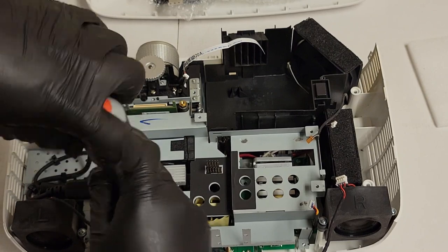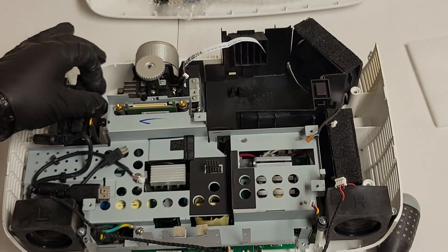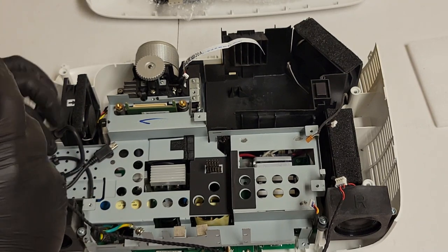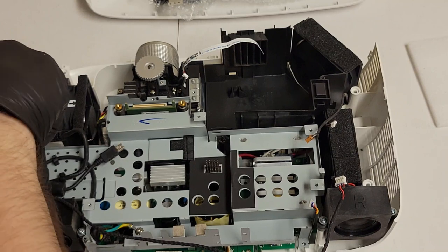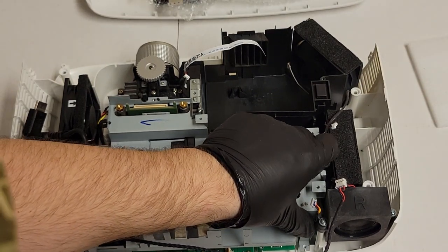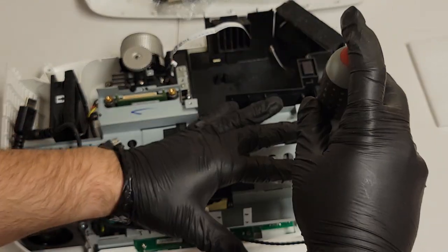Now, sometimes you need to give things a little bit of love to get them back into place, but it still should drop back in and sit in place. Like if this went in and it was kicked up like that, I'd have to check to find where the wire that got caught underneath was, because usually that's what happened. Let's pull those back out of the way. Then we have our screws that go through this and then through the main board. I lucked out on that one. That one was already in the slot properly. There we are. Oops. Teaches me for looking away at the camera.